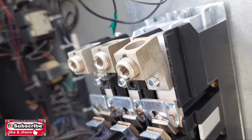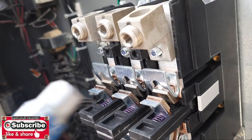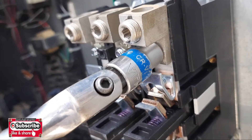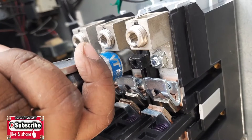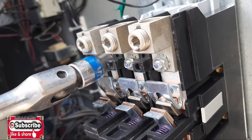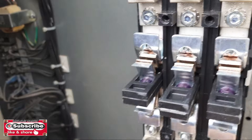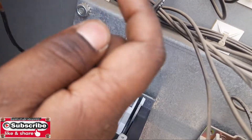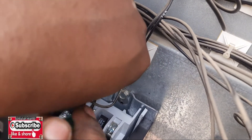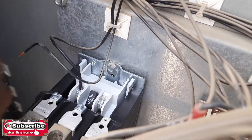After fixing all six connectors, you must confirm that the strength of the bolt nut is good — check all six connectors one by one. After this, you can fix the three-phase cables. You must place all cables in the same position as before. This is our 110 volt coil — we fix the two coil cables that came from the control of the chiller, because the chiller control is 110 volt.